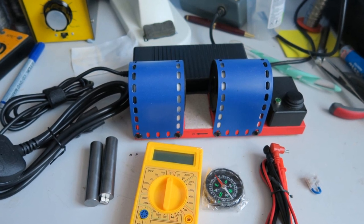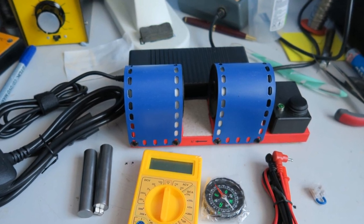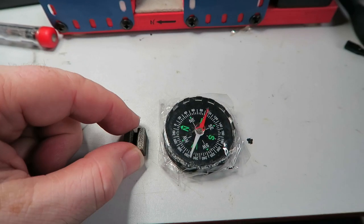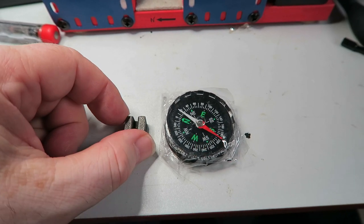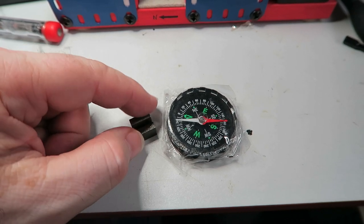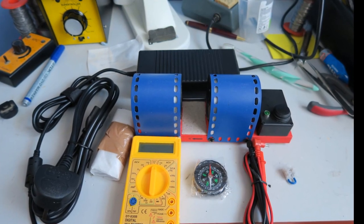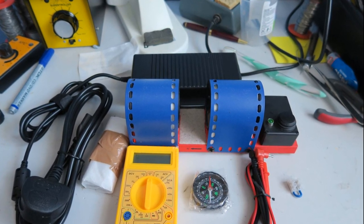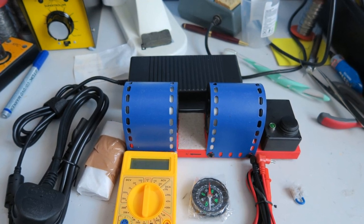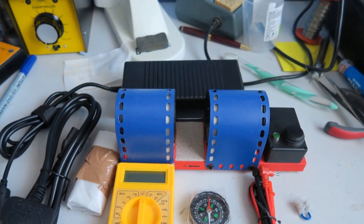You might be asking why do you need to remagnetize your magnets. These old magnets do eventually lose their strength over time. The electromagnet caused by the commutator and the power you supply to the track reacts against the permanent magnets, and this is what causes your motor to spin. If the permanent magnets become weak, you'll need more and more current to drive the armature to cause it to spin. This causes a lot of heat within the motor itself, connections can begin to burn out, and you just don't get the good performance you'd expect. By having a nice powerful but not too strong magnet as your permanent magnet, you get the best of all worlds.